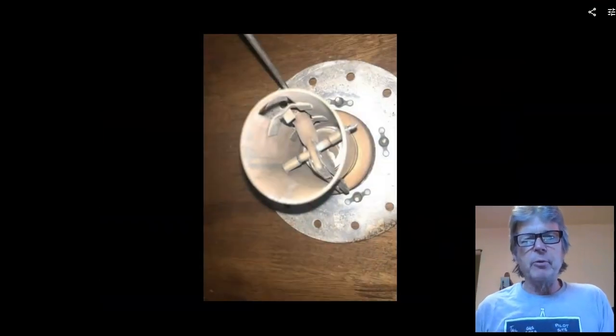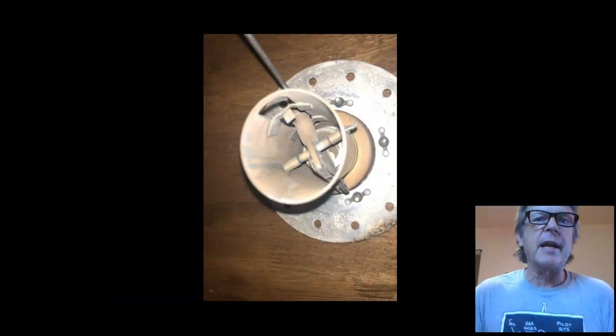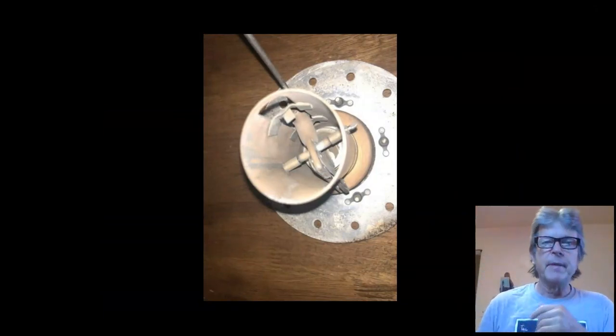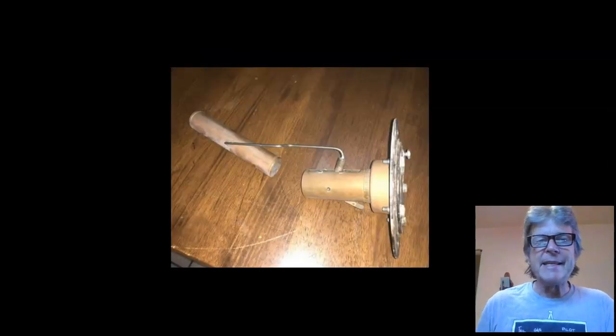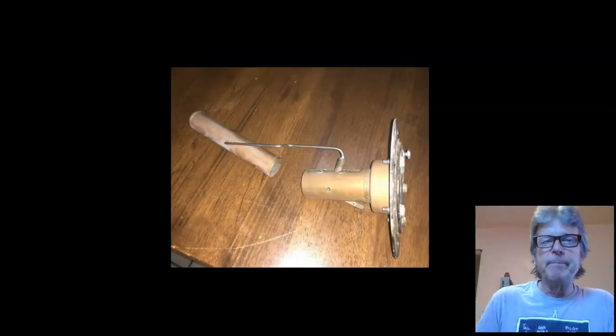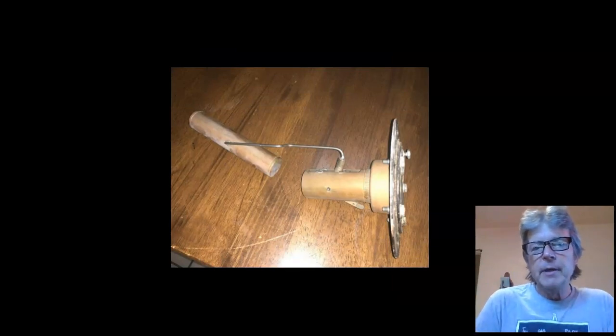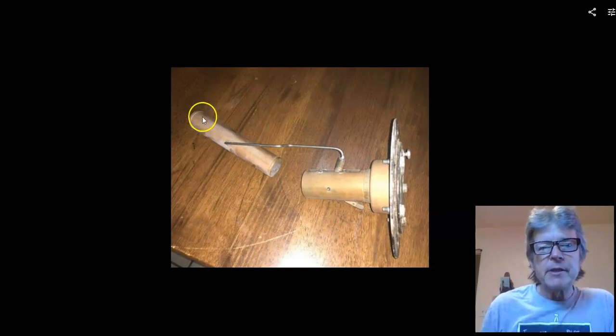Now let's talk about the Cessna 320. So on the Cessna 320, inside the fuel tank, this is for measuring how much fuel you have, fuel quantity. Inside the fuel tank is this type of thing. It's a float. Similar to our cork float, this is in the sidewall of the tank, and as the tank fills up, this float floats and moves this arm.